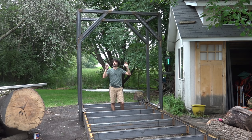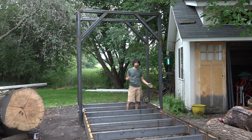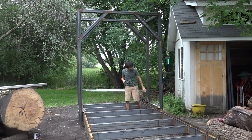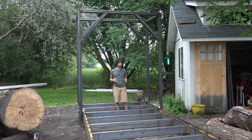When we got done welding the braces and we removed the temporary braces that were holding the legs apart, the whole thing came together and actually pinched together on the rail. Now this thing is designed so there is a gap about 3/4 of an inch between the rails and this lower member here, and that was completely closed and squeezing the rails so you could not move the carriage. It actually clamped itself in place.